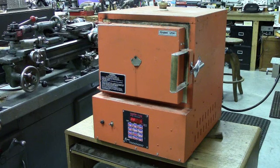Okay, what we're going to do here is attempt to do a live filming of a live investment casting demonstration. We're looking at the burnout oven right now, and there are six stainless steel flasks in the oven that have been in there for about 8 hours going through a regimented burnout cycle. The flasks have completely burned out. All of the wax that was inside of the investment is completely gone. The flask temperature is roughly 1100 degrees.